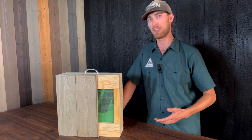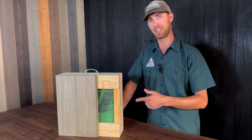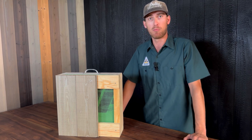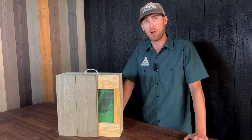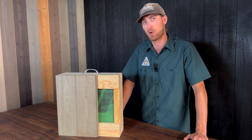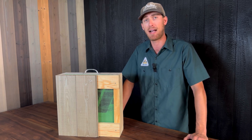If we're using a traditional house wrap like Tyvek or something similar, we probably wouldn't want to be using this same system. Our weather resistant barrier is really the primary defense of moisture protection in the house, and so these types of details need to be considered when you're choosing your exterior sheathing product, your siding product, and your fasteners.